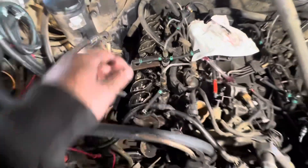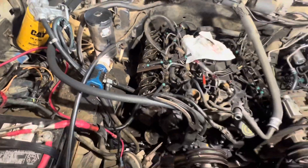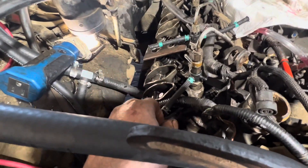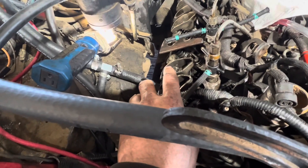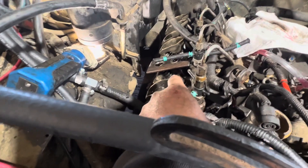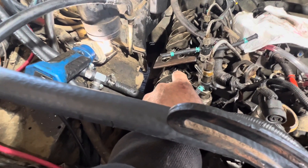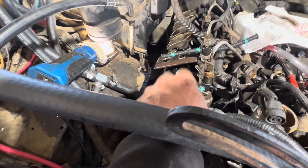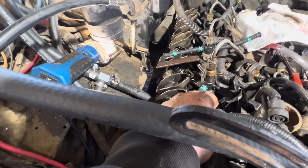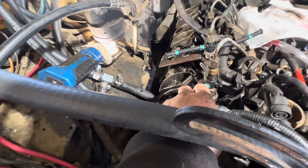We're down to our last one, the last intake. We've done all intake and exhaust — here's our little tool we made to help get it out. All the exhaust umbrella seals just crumbled; I think there were three or four of them. Three that they did not replace with a positive stem seal. But this one — cylinder three — looking into it, I can't see any seal on there through the springs. We're hoping it's this one. If not, we've got stuck rings — stuck oil control ring and scraper ring — which we'll cross that road. But fingers crossed, this is going to be it.